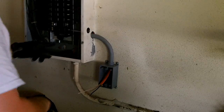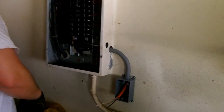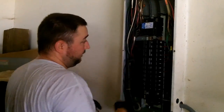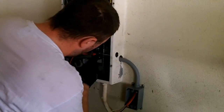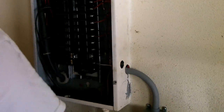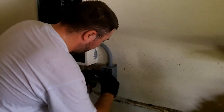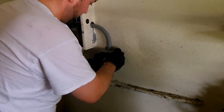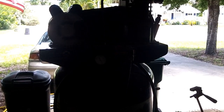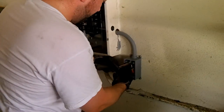Don't test the wire, we just tested the breaker. Let's double check it just to be safe. I've already actually checked the bar itself and I know that there's no voltage there, but just to be safe. All cold, good. This wire is so thick — 10-gauge. That is about where I want to cut. 15 amp compressor on a 20 amp breaker using 10 gauge wire.